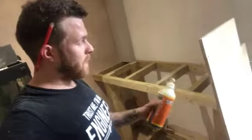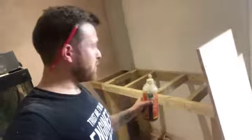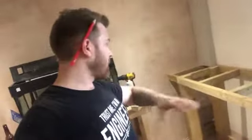And then as this foams up underneath the top, once the top's properly secured, it's going to fill up any little imperfections that are potentially still left underneath there. Meaning the ply, which is essentially taking the weight of the tank, is completely spread out evenly, and that will allow for a really solid top. So let's crack on.